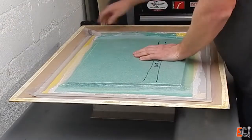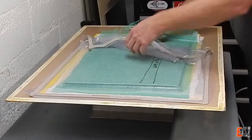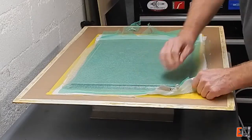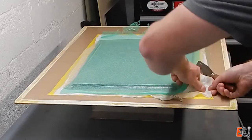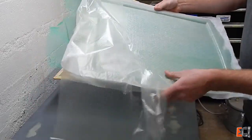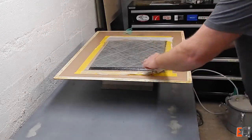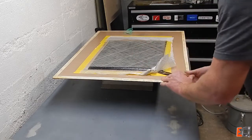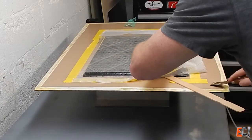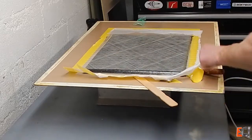So here we are — it's all cured up. The one thing I did was give this some heat in the cure, running it up to about 40°C. That caused the resin viscosity to drop, and that combined with the high vacuum and the mesh meant we bled off quite a bit of resin. That'll be neat to see about this panel — see if there's enough left. The breather is super crunchy, like a ply all of its own. You can see the top layer is already looking a little white where the heavy bundles of glass are. I'll slip this putty knife carefully in there and demold it. I have paint stir sticks with a little wedge on the end — once I open it up I try to use those because they don't scratch the Teflon as badly. This should pop off nicely.